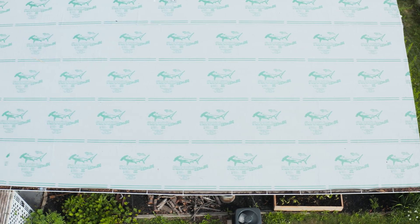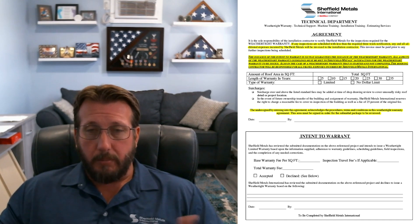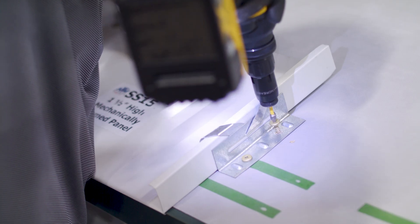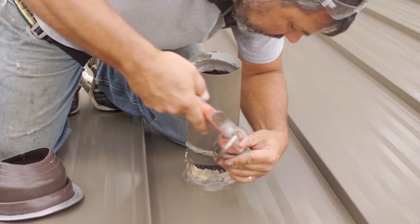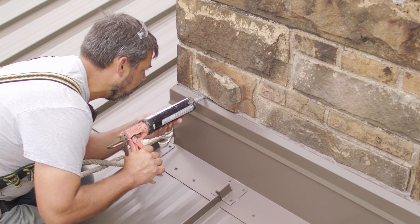We approve one underlayment right now as our standard, which is the SharkSkin product. It doesn't make sense for a company like ours to carry 15 different products. If there's a problem with the spec, another underlayment can be approved — one that can meet our standards and requirements. The quote form and application walk you through the whole warranty program from start to finish: the moment you apply, to receiving paperwork, all the back and forth, until the project is closed out. We look at different coating types on fasteners, the different properties of sealants — some sealants stick better to metal than others. We've all seen sealant not made for metal used on it — you can pull a bead right off with your finger.